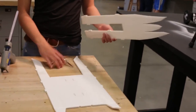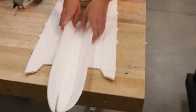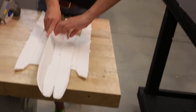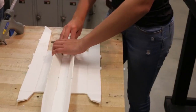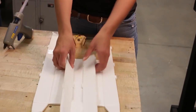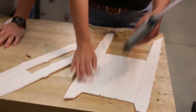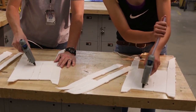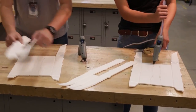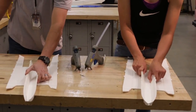Let's start building. First, grab your fuselage, belly pan, and motor. Bend the fuselage and dry fit it to make sure it fits well. Also check how your motor mount fits in. Once you've confirmed the fit, don't glue it yet. Then glue all the way down the teeth and the rest of the fuselage. Do not glue the motor.